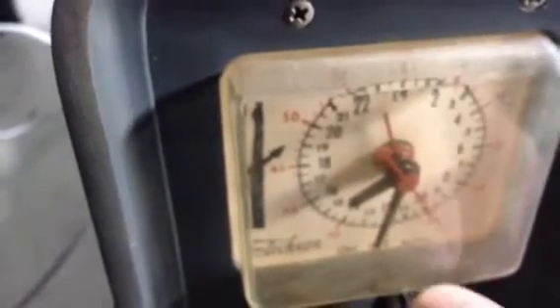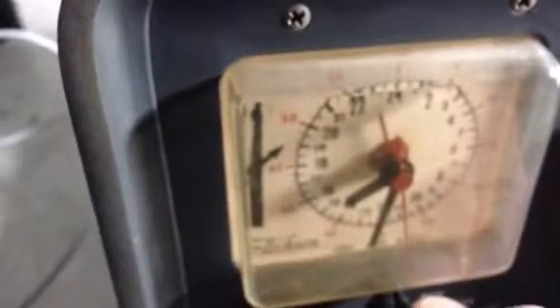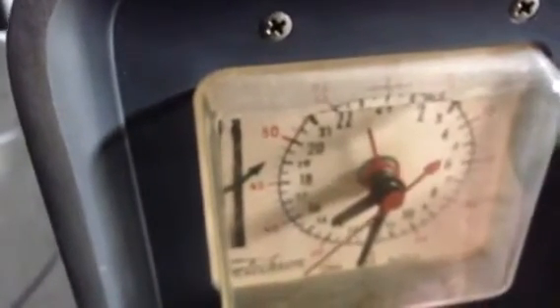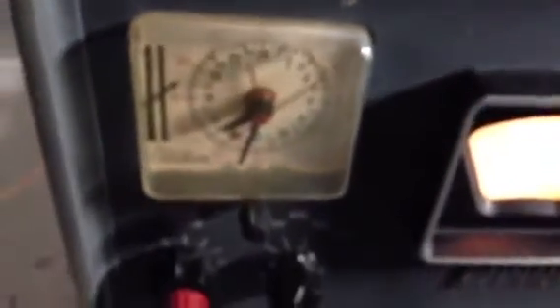The clock is working. There's a switch that goes from off to automatic to on. In automatic, if you select the appropriate pointer position on the clock, the unit will come on by itself and get warmed up. You can also turn it on manually or turn it off completely. By the way, I've purchased probably a dozen of these receivers and several have come to me listed as 'does not power up' — that's because somebody turned the clock switch to the off position, which completely renders the on/off switch inoperative. If you see that on eBay, the guy probably doesn't realize there are two on/off switches.